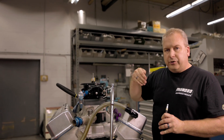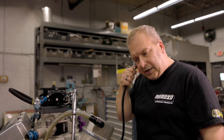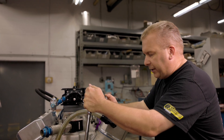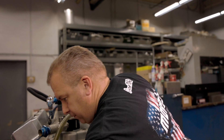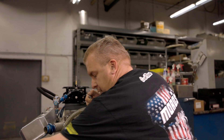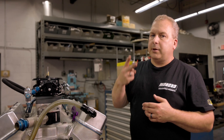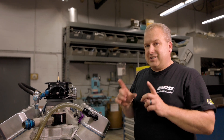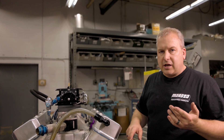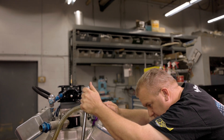To figure out where your cylinder is coming up — at the racetrack it's loud — sometimes what I do is hold this thing and listen to the air blow by my finger, or rest it up by the side of your face, and when you feel the air coming out you know you're getting close. As we turn the breaker bar, we are waiting for the air. You hear it — we know we're coming up close to top dead center. So now I'm going to look at my balancer and timing pointer and get this thing to about two degrees before that cylinder is at top dead center. My suggestion is get your balancer set up with a mark at 0, 90, 180, and 270 so you can tell what cylinder you're coming up on. In this case, we're going to go to zero for the number one cylinder, and move this thing two degrees before top dead center.